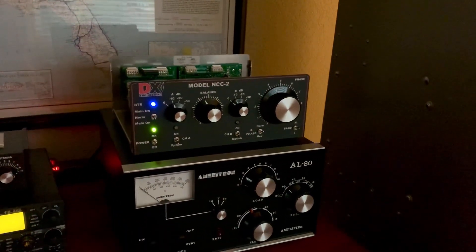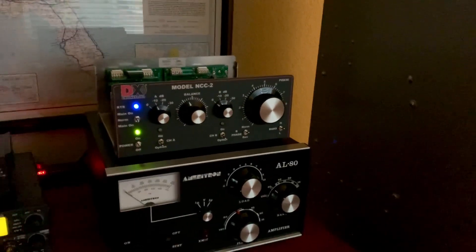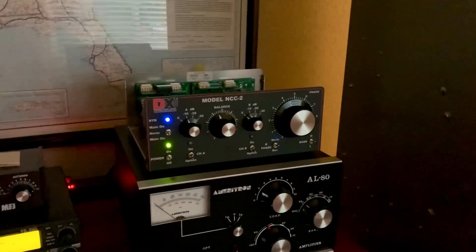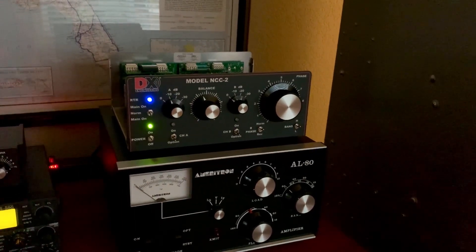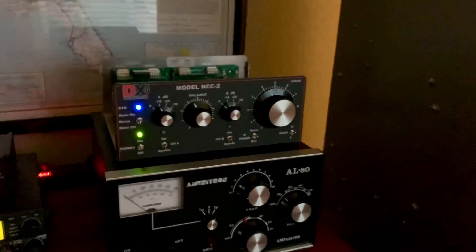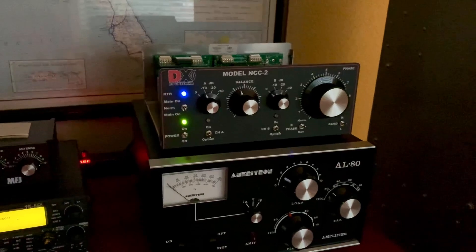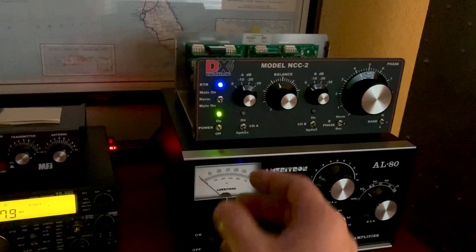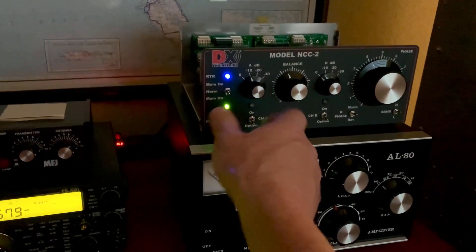There's just no activity right now. I have my 20 meter dipole hanging off that vertical. It's insulated for the vertical and the ground — everything is isolated from that vertical when I'm on the vertical by itself. I'm tuned up on the 20 meter dipole right now and I'm phasing that as the main antenna, phasing that with the loop. So it works great. The antennas themselves hear a lot more than the loop, so I have to always attenuate either my vertical or the dipole at least 10 dB.